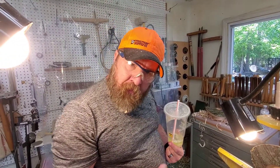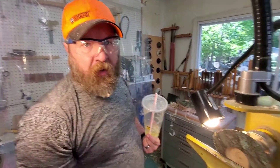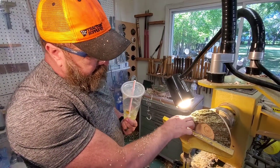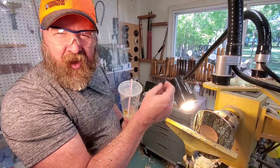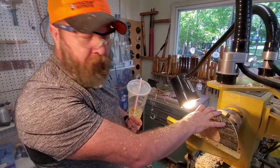As I remove that support, I'm going to be heading back to my support back here. We've got to do it in one cut. The big trick for these is holding the tool in the same place as it comes out of the wood - if it's naturally pulled - and it enters in on the other side. Because if there's any movement of that tool, you get these little lines. You can sand them off, but if we can avoid that, we obviously want to.